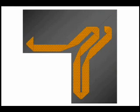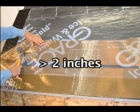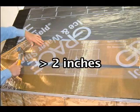It is very important to lay out the heating element runs either on paper or on the area to be heated prior to installation. A detailed layout will result in a superior installation. For snow melt applications, the Z-Mesh is designed to be installed with a 2-inch space between runs for maximum efficiency.